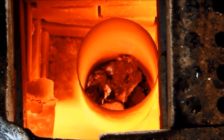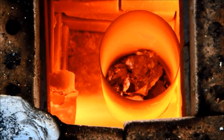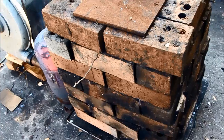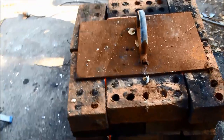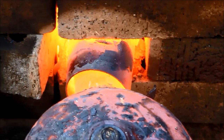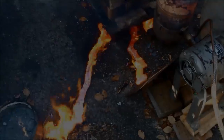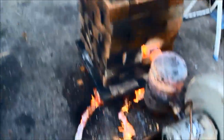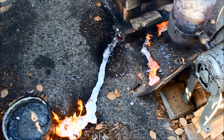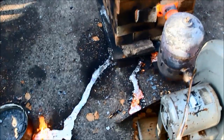The bricks opened up a bit and I did manage to get the top on it, but after about two — maybe three — minutes with the top on and the burner still pretty much idling, as you can see there are no flames coming out, I struck disaster — much to my surprise. Here you go viewers, this is what you call a major fail. I don't know what happened but all my aluminium has escaped clean out the bottom of the burner. I've got stainless steel in there as well as the crucible itself, and it's obviously gone right through — somewhat of a catastrophe.